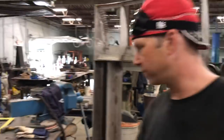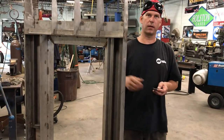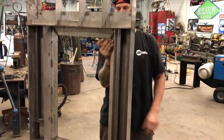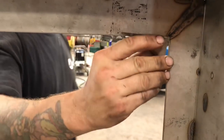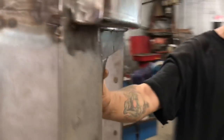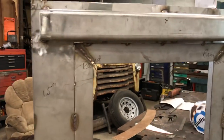The other thing we still have to do is the rubber molding for the window that's going in here is pretty thick, so it can't make a 90-degree turn. We've cut these pieces here that we'll put in each corner on each side, then shape them and make sure they're all uniform. It'll look good from the inside. Once we have those in there, that rubber mold shouldn't have a problem fitting around those radiuses.